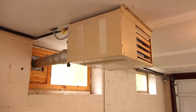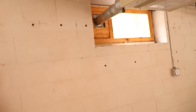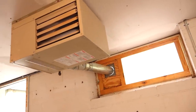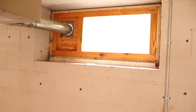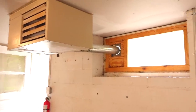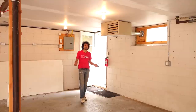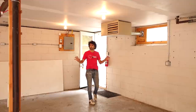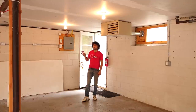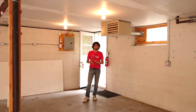The electrical just needs a 110-volt connection, and there is a thermostat on this wall. The only other thing for these units is going to be an exhaust — this is not a high-efficiency unit, so it does combust the interior air and shoot it outside. I made a window insert with a little hole so I can run the actual exhaust out through the window, since it can't easily go up through the roof or through the living space above. This thing does work really well for the space. It brings up the air temp really quickly. This garage space is partially underground so it has a little bit of a thermal break — if I don't run the heater, the coldest it ever gets is about 32 to 34 degrees, even when it's negative 20 outside.